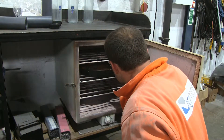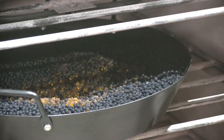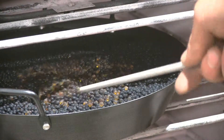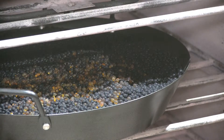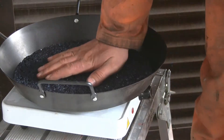Once I went further, all of a sudden I realized I was already destroying the whole thing. The whole batch of silica gel that I had, what you see here, is actually wrecked and no longer usable. Once you overheat it, the moisture comes out but it also destroys its ability to absorb moisture.